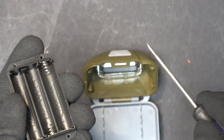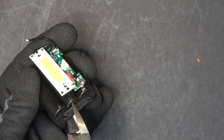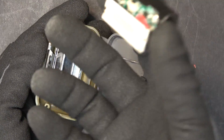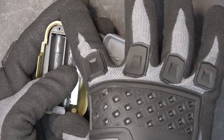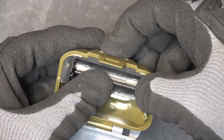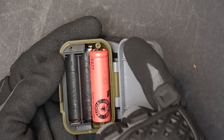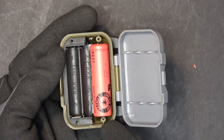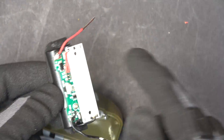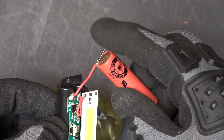I'm going to cut out half of this battery housing. This can be easily cut with a cutter. The battery holder is cut in half and it's going to fit in here — it still looks good from the outside and I can still use the power button. Now I have room for a 14500 battery. I'm also going to cut out the two screw mounting holes to have a little more room. Then I solder a couple of wires onto the battery terminals and a nickel strip onto the wire so I can use a magnet to stick it on the battery.